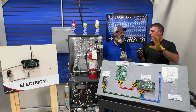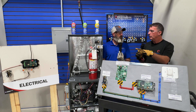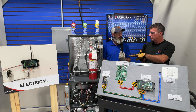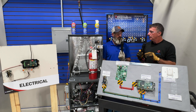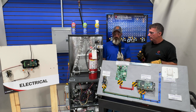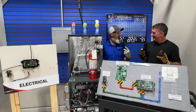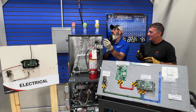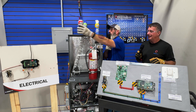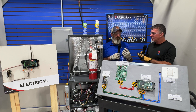Okay Tom, so we went through our five-minute mitigation period. Our blower has reset and we're not detecting refrigerant, so we're basically in idle mode. We've tested it with 1234yf and our refrigerant detection sensor went into mitigation. How about we try another refrigerant just out of curiosity? I like it, let's do it. The red can is actually 134a.